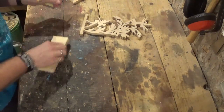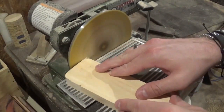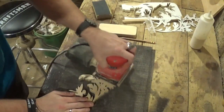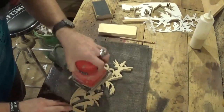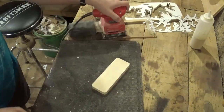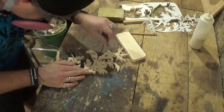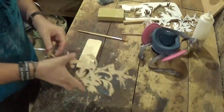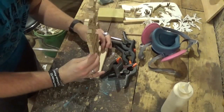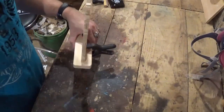We come back over to the workbench and use a washer to draw some curves, then take it over to the disc sander and give the base some detail by sanding up to the line. Back on the workbench with a high-grit sandpaper on the palm sander, giving it a nice sanding. Going over it with a sanding sponge and even higher grit sandpaper, then cleaning it off with a paint brush. We're going to use basic Gorilla Wood Glue to attach it to the base with some spring clamps and let that dry about an hour, then remove the clamps — and the project was completed.